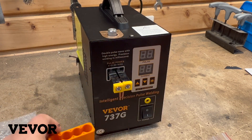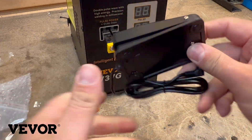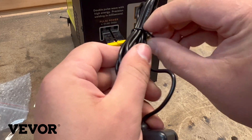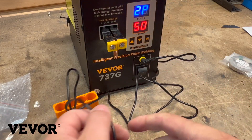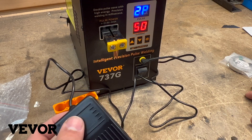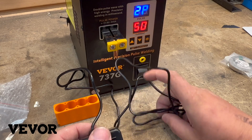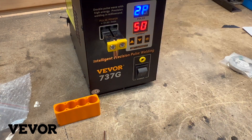And some packs of nickel strips. Interesting choice of plug — it's like a DC power socket barrel plug. So there's obviously a big contactor in there; you can hear it bouncing. Whenever you click it, it knocks the contactor closed, which connects the output from a giant transformer and dumps all that power into your cells. Let's test it out.